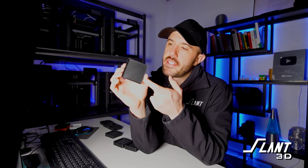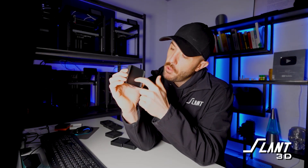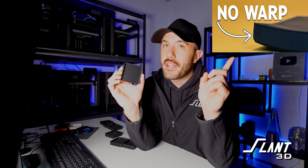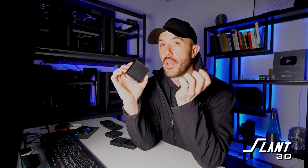The operating theory is that this occurs because layer time is different — it spends a lot of time printing that thick base area. But we know from warping research that changes in geometry are generally due to long pieces of material that are connected, then pull and squeeze as they cool and shrink. This top surface of the base is a large amount of material that is shrinking and pulling in. Separating it from the outer wall makes the part weaker by removing connectivity between layer lines, which you don't want.